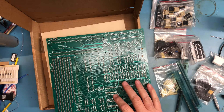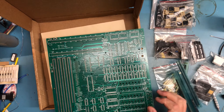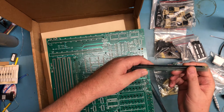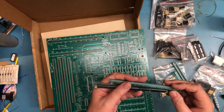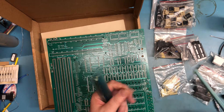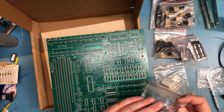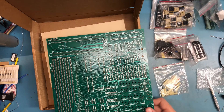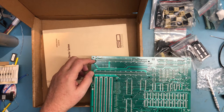There's also a PROM programmer and a little bit of glue logic. I'm not sure what kind of memory chips are in there. Looking at the logic chips, a lot of the leads are dark — this has obviously sat in storage for a long time, so we may have to clean the leads. I'll actually shoot a video on doing that. The chips in plastic chip carriers are okay, though I can't see their leads directly.